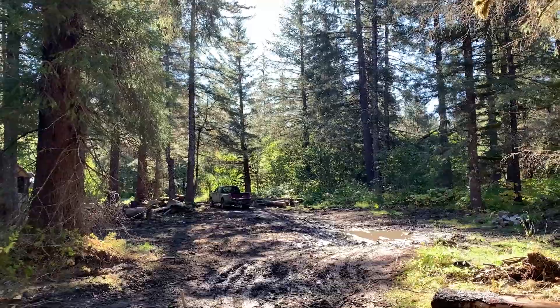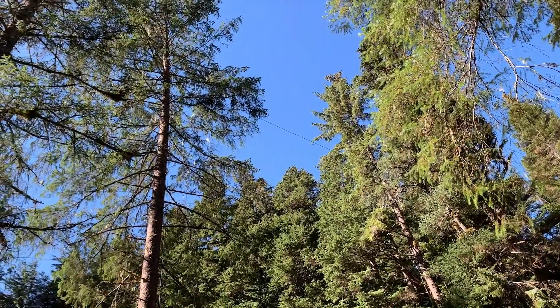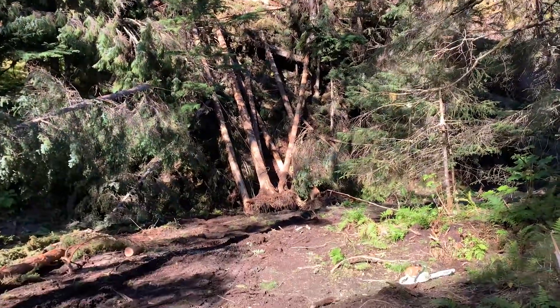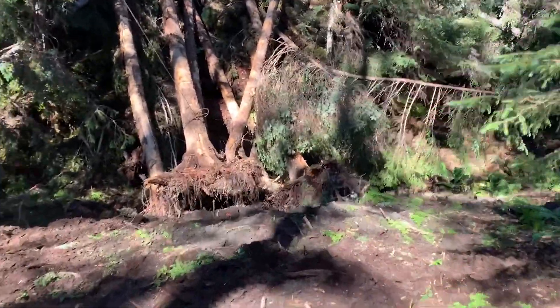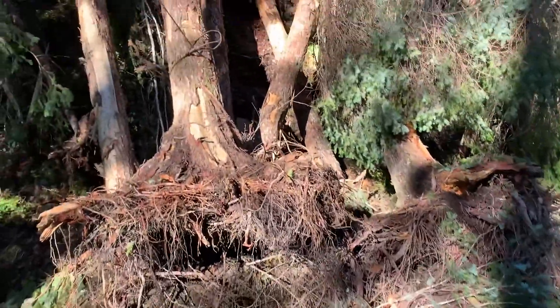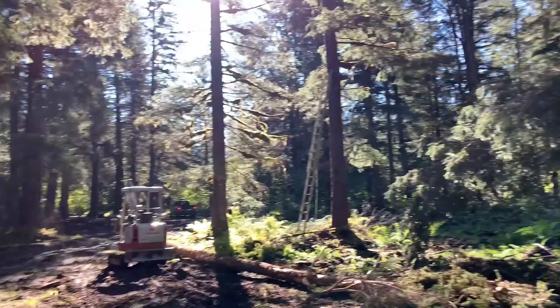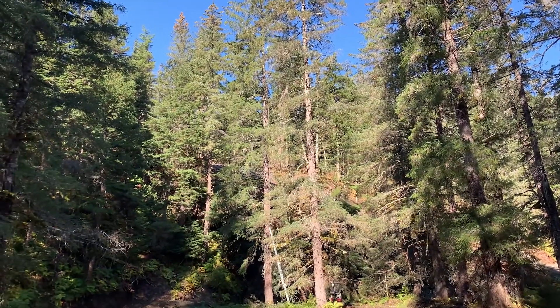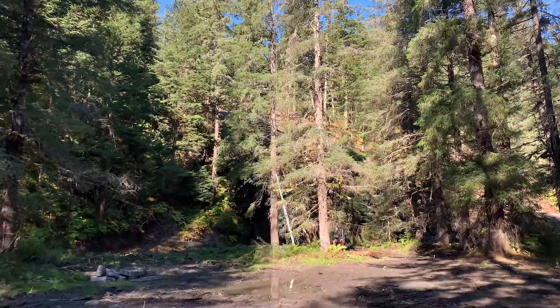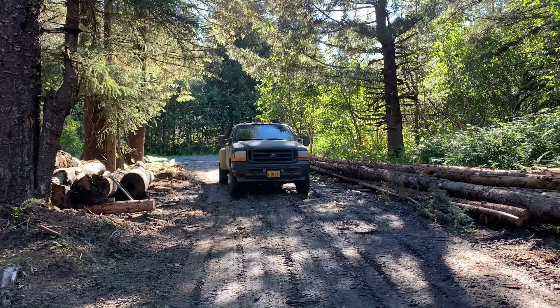Here's how this is going to work: Matt pulls forward, there's a redirect up there. It's going down and we're trying to yank these guys out — they're stuck in the ground in our drainage ravine, so we have to lift up and pull at the same time. Matt is going to turn around — we were pulling with the rear side, but because our crane is lifting up, the harder we pull the higher the rear gets lifted and the less traction we get. So we're turning around, pulling backwards with the rear tires not being lifted, and the only lift happening in the front, which is super heavy.